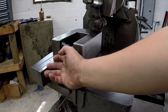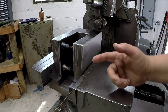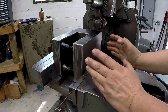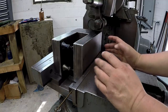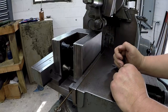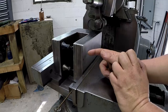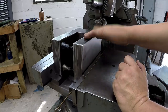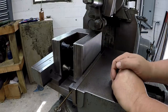We've got our vise squared up there, and now I'm gonna cut it this way. Whenever you have a longer cut, it's actually beneficial as far as your cutting time to go the longest stroke versus across this way. You're cutting more material this way with minimum backstrokes. It's just faster to do it that way. So I think we're gonna finish it out in that direction.